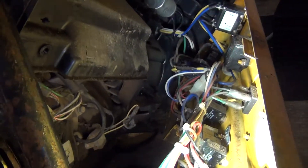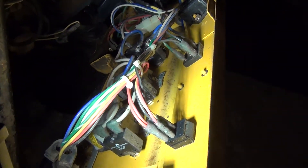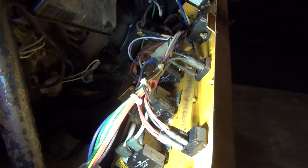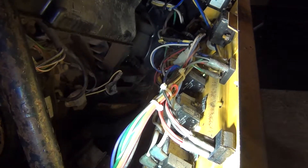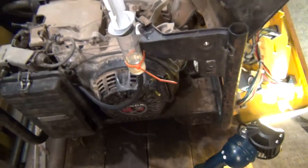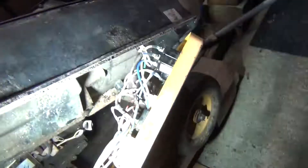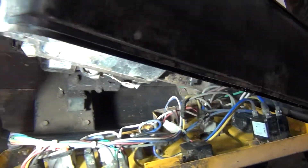What a surprise — there is no voltage regulator here either. So to sum up: you cannot adjust the voltage on this generator unless you raise the RPMs, which raises the frequency. That's only this screw here, and that will raise the voltage. That sucks. If somebody has a better idea, hit me back please, and good luck.